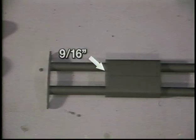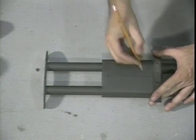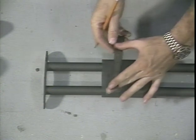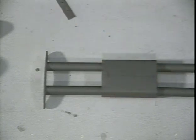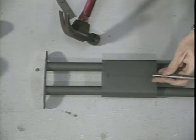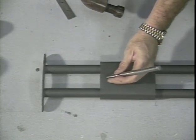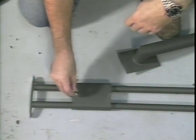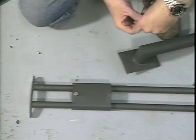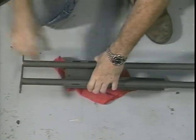The construction print shows the 5/16-inch bolt holes in the attachment plate are located 9/16 of an inch from this end and 5/16 of an inch from the other end. Locate the holes and mark the hole centers on the support tube weldment, and check the bolt holes for fit. Using the support tube weldment as a template, locate the bolt holes in the mount tube weldment.